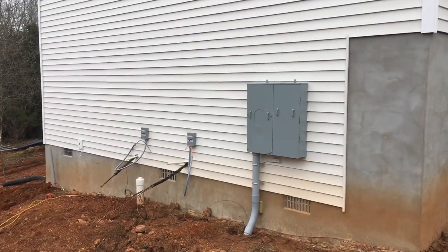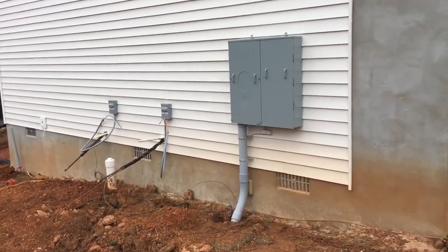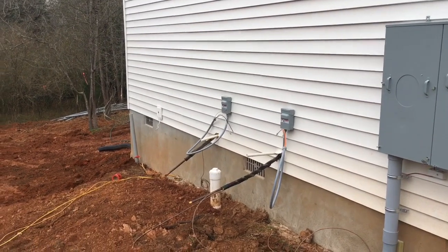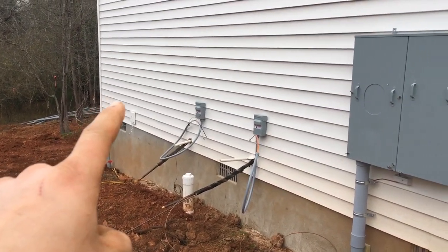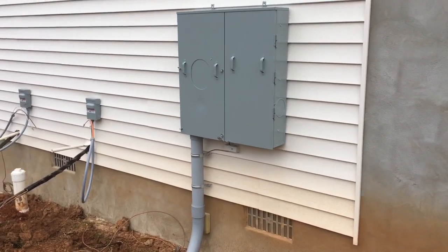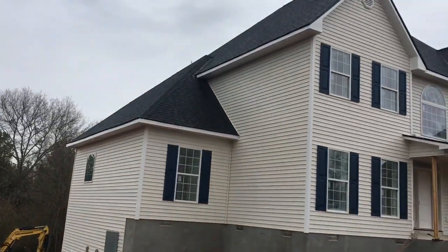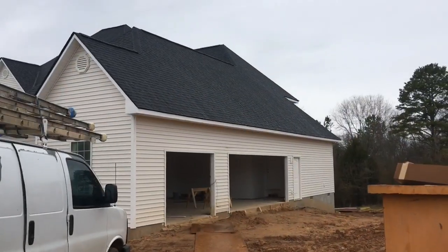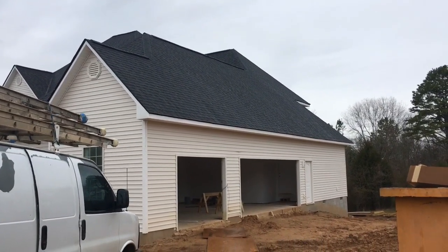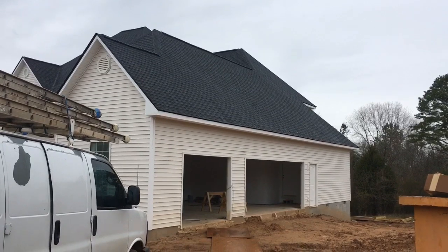This guy's got a ginormous meter base — you can have two heat pumps, it's a four-bedroom house — and we'll probably just tie in right there with a breaker. You can see where the solar is stubbed up, so we'll go inside the crawl space and come around back and pop in right here. These folks were Californians who came here, and originally they wanted to put it on this roof and then that roof. Unless you really plan your roof from the get-go to face the right direction, I don't recommend roof-mount solar if you've got a spot to put it on the ground.